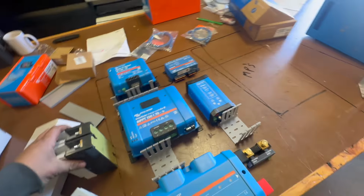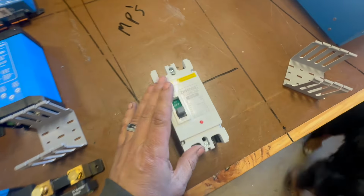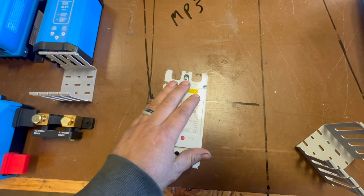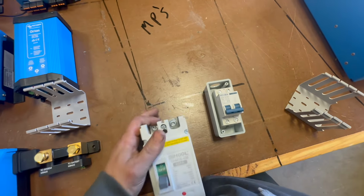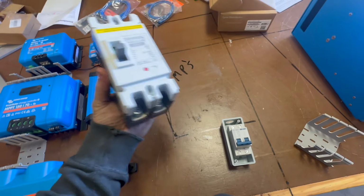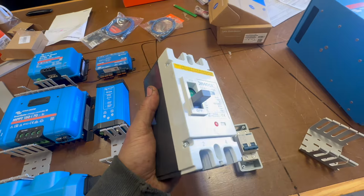And the other thing, as far as safety stuff goes, we got a 400 amp DC-rated double pole breaker, and then we're going to have our solar breaker in there. I'll review this real quick, for those of you who have been following our channel for a long time: we love using these instead of the traditional disconnects. And it's a great time to talk about this.